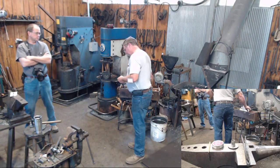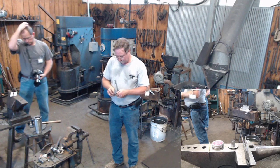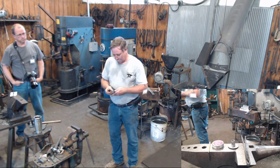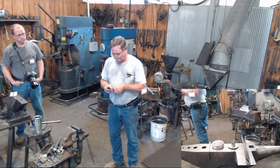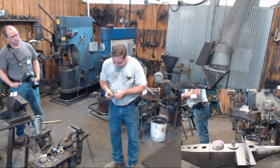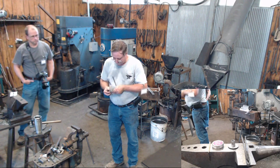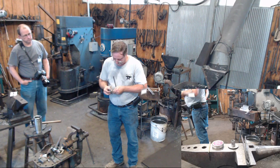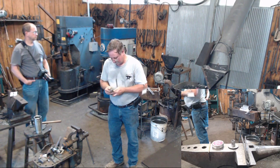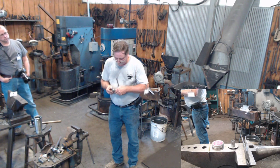The nice thing about buying rivets, if you don't use a lot of them, I would recommend buying a longer rivet. That way, you can cut them off and make shorter rivets out of them. And it's infinitely easier than making a short rivet to begin with, I have found. We may have to put one in for visual purposes and then clean that hole up a little bit.